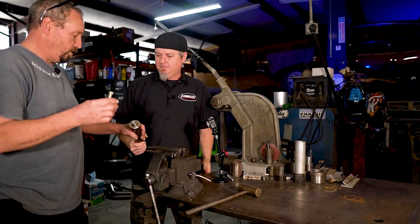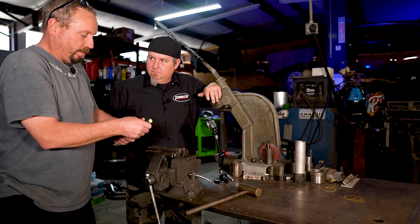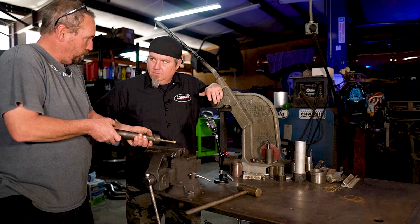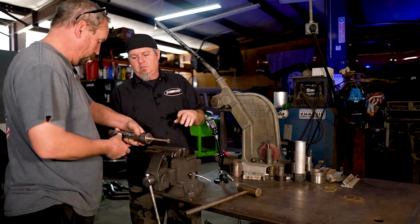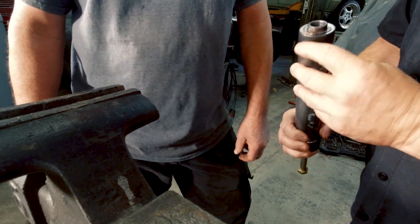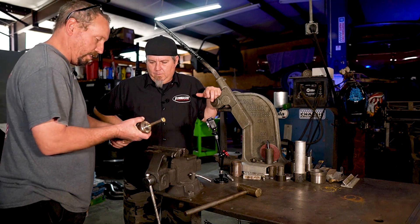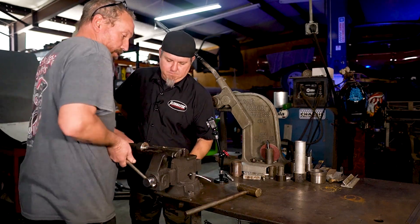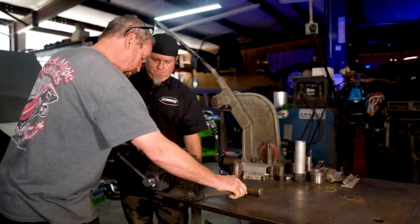So what do we got to do to get this thing apart? First thing I do is just screw a bolt into the end of the cylinder. A lot of times these pistons get stuck down in the bottom where they weld — it could shrink it up a little bit. When we make our plug we'll make it so it press-fits in here, so we'll actually heat this up and then put the plug in. These ones here, they're welded but they're threaded in there as well. So they're super strong. This has got to come out because we got to shorten it — it's got to be shorter, and our fitting won't be on the end like this. It's gonna be off the side. So stick it in the vise, stick the bolt in the vise. Tap it with a brass hammer — once you get started it pretty much starts going on its own.